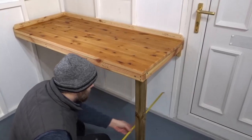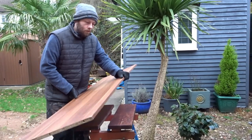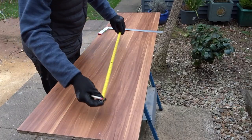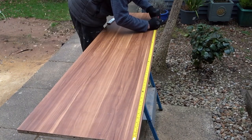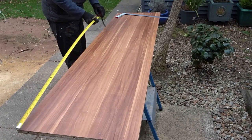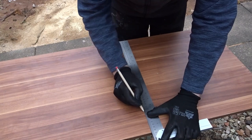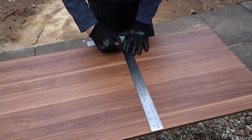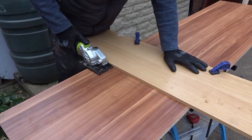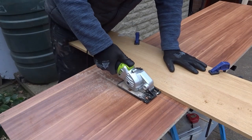I started off by taking some measurements, and for the shelf I'm going to be using this veneered chipboard which I found thrown outside some flats near some bins — I think it is a cupboard door. To start off I need to cut this down to size. The depth just happens to be perfect for the shelf but the width is too long, so I'm cutting it down now. I'm using a square to make a nice obvious mark, then using a straight edge and some clamps I can make the cut with my mini circular saw.